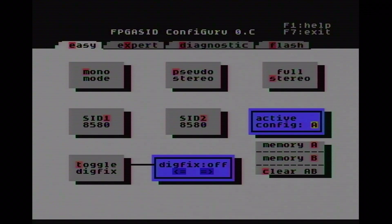So much about the different SID models. As a rule of thumb: if you buy newer games for the C64 like Sam's Journey, YAMP64, or newer Psytronik or RGCD releases, most of those are using the newer SID model. If you're looking back in time — talking about the 80s and 90s — most of that stuff was produced for the older SID. Therefore you're quite flexible with your SID model and you don't have to disassemble your C64 all the time when you want to switch between different game titles.